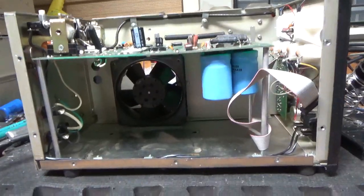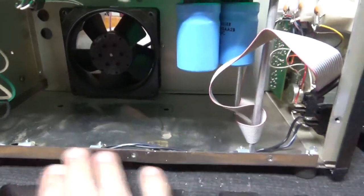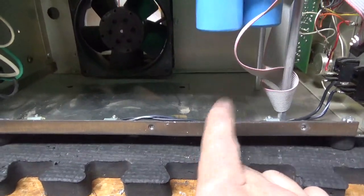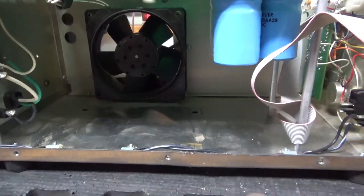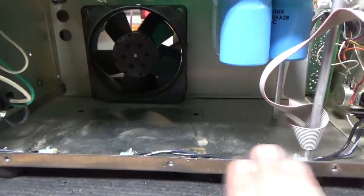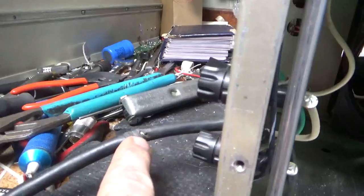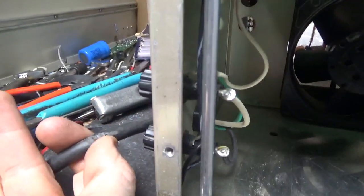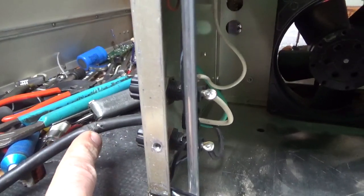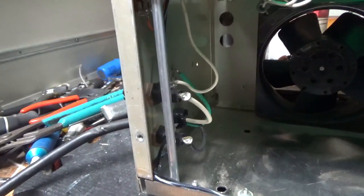The transformer's out. I was missing the screw right here, so because of that the floor did not have any support on the side where the transformer was, and it's bent up a bit. I bent it back the best I could. That's why it's really important to have all of the cover screws in — it gives the case structural support. The cord has damage to it; it's not going through the internal conductor, just the outer sheath. So I'm going to unsolder the leads, cut it, and redo it.